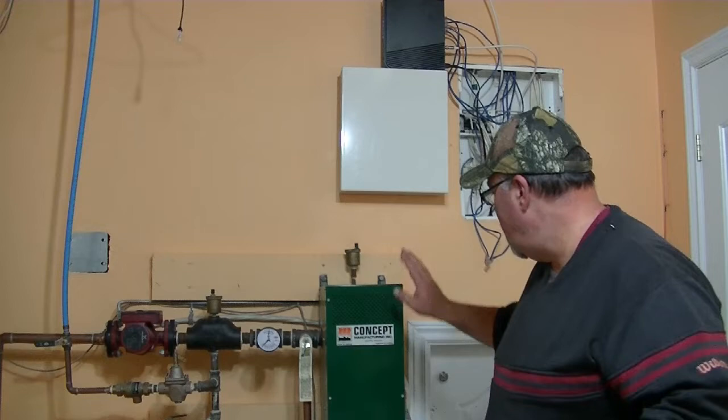In-floor heating — mine, as you see behind me, is a hot water boiler, and all this fun stuff. I'm going to go over it with you. Hunter happens to work in concrete doing foundations, and happened to talk to one of the guys putting in an in-floor system, and he asked about maintenance. I was quite shocked that this system should be flushed at least once every one to three years. I've been here for 12 years without flushing it, so I can imagine what gunk this might have in it.